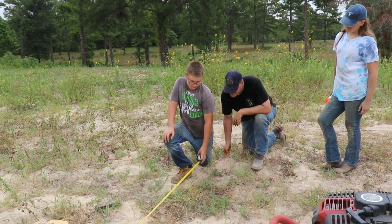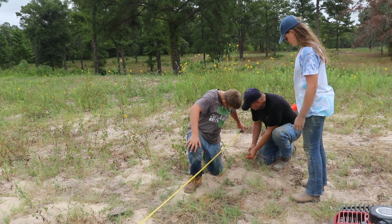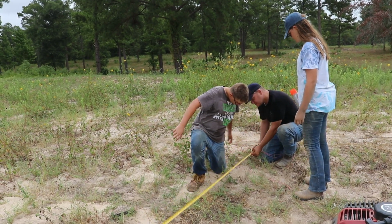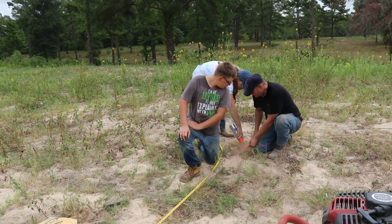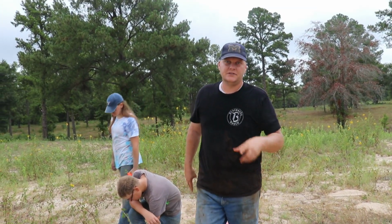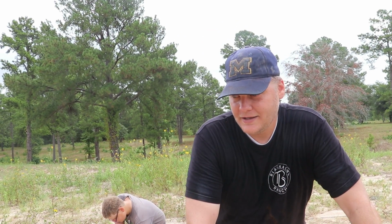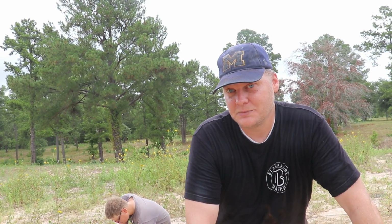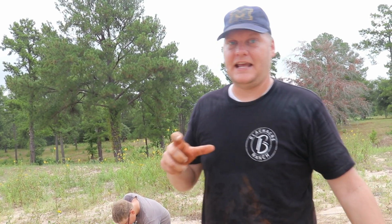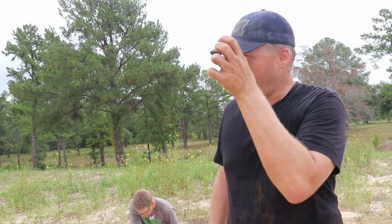Okay, come out 16 feet. Like this. Yeah, it is. Okay, good. So we're gonna put the 16-foot gate. We have two 16s. One will be on the other side of that funnel, and the other one here. Gates are made smaller than the actual dimensions, so the 16 feet is the actual opening. The hinge is accounted for within that.